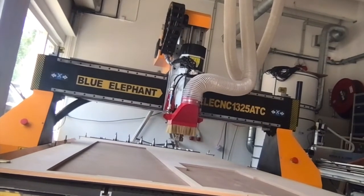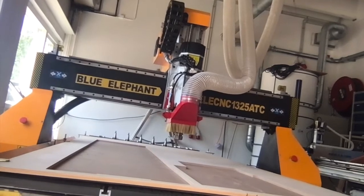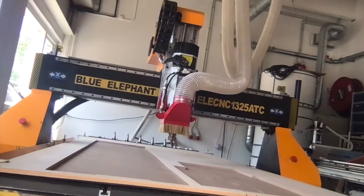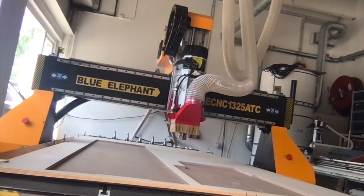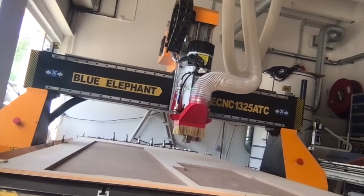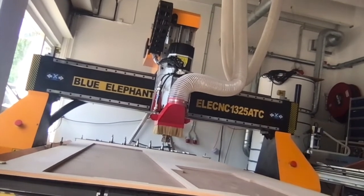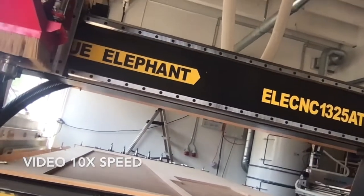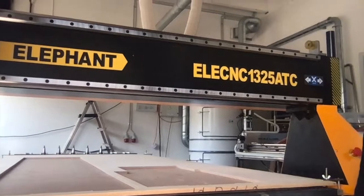Now it's slowly doing the circle at about seven millimeters deep it thinks, then doing it again at about 13 millimeters deep it thinks, and now doing the edge twice. I reduced the size of this piece so we're not going to waste so much wood showing you how to do it. Now the job's finished, so let's do it for real this time.